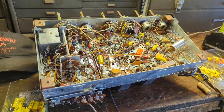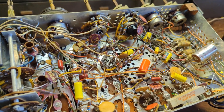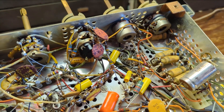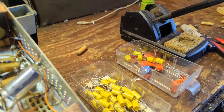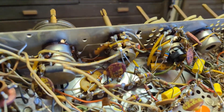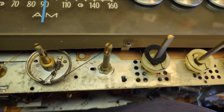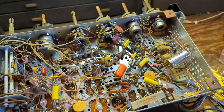It's Memorial Day week, I've got nothing else to do. I'm about a little over halfway done — got 10 caps replaced out of 18. It uses a whole lot of 0.047-rated caps — six of them, which I believe are tone control-related. I'm running out of yellow ones so I'm using orange drops and some amber-colored ones. I've also got to replace the electrolytic, then clean the pots.